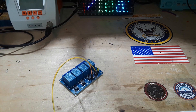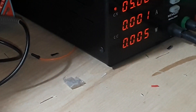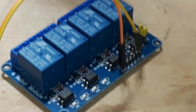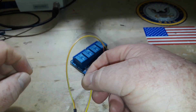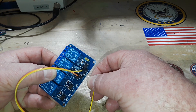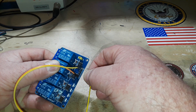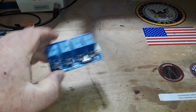Alright, we have five volts on the power supply. It's pulling about a milliamp. These are low-level trigger signals, so I have this connected to ground and all I have to do is ground each pin and you can see them activate. I move my finger onto each relay so I can feel them click. That's it — I like these.